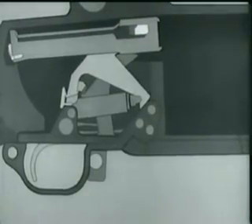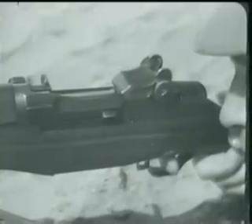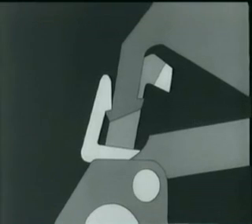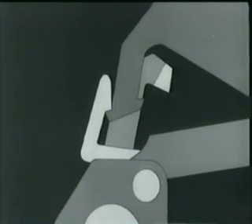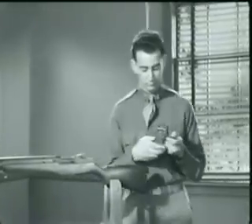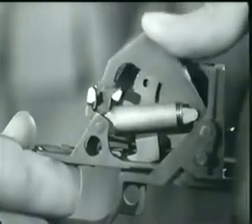As the bolt moves to the rear, it forces the hammer back, which compresses the hammer spring. The bolt is back and the hammer is caught by the sear. Notice that the trigger is still all the way back after the hammer is caught by the sear — the reason is that the hammer is back before the finger can release the trigger. Now we let the trigger forward. It frees the sear from the hammer, which starts forward, but it is caught by the trigger lug. Here's the trigger mechanism on the rifle itself — watch the hammer move up and catch on the trigger lug as the trigger is released.